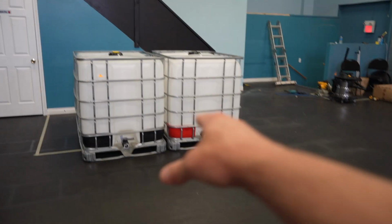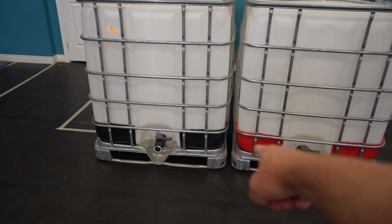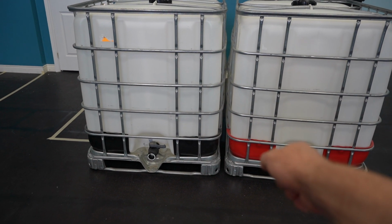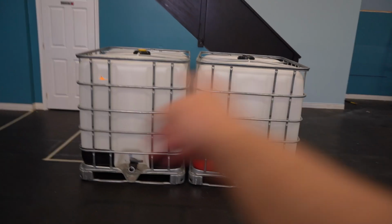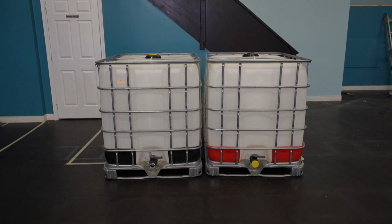So yeah, water changes. Then I'm going to connect the two down here with a ball valve in the middle, which I can open whenever I have a tank that I want to fill, and it'll just gravity feed, because we're coming down from almost 8 feet, 7 feet in the air, down to the tanks. It's going to drain with 1.5-inch hose, super fast.